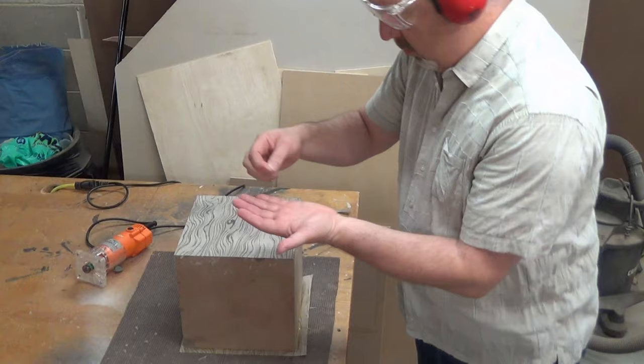And what I noticed, as you can see in the video, that after I got done trimming it, there was this fluff every place. I didn't know what that was about. I figured it had something to do with the fleece, but, you know, and even when I unrolled the veneer, I didn't know what side was the backing side and what side was the wood side. I actually had to cut a couple test pieces off and do a test piece just to make sure that I was gluing this stuff on right, because it's really not easy to tell.